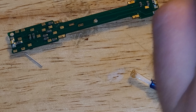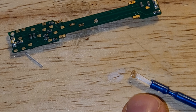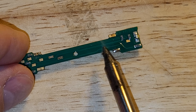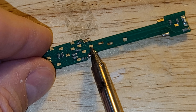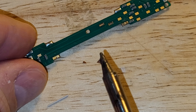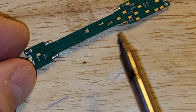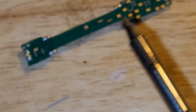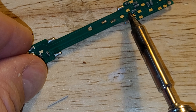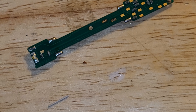With the flux in place I'll try again and should have better results. This decoder is well beyond its warranty — it's at least 10 years old and I don't have a receipt anyway. You can see the difference immediately — the solder sticks right to where I want it. Putting another one on, then we'll turn it around. My usual disclaimer applies here: this is quite dangerous, so know what you're doing. Gently running it across the pads, very careful not to heat this up too much.